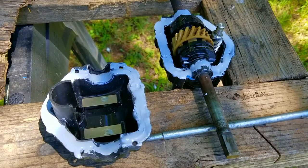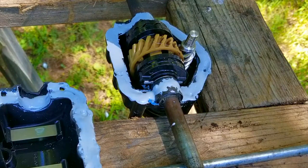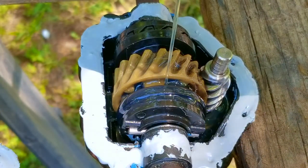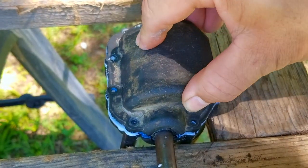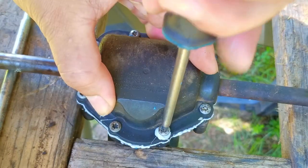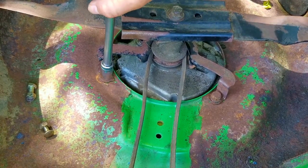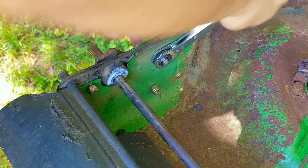Here's the cover and lower portion with sealant on the mating surfaces. It looks messy because whoever took the case apart the first time gouged both surfaces pretty badly, so I'll have to go heavy with the sealant to compensate. Next I fill the larger lower portion with gear oil and watch for any leaks from the top seal — I fill it almost level with the mating surface. I let the sealant tack up for a few minutes before carefully replacing the cover and all the screws. After that I put the belt and its guard back on, work the belt around the blade and onto the pulley, and slide the axles back into the bearings. Once it's back on the mower, don't forget to connect the cable to its anchor on the belt guard.